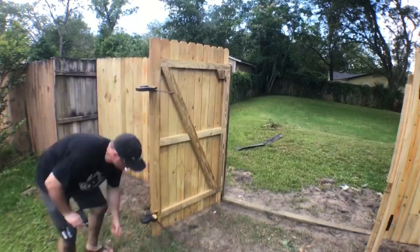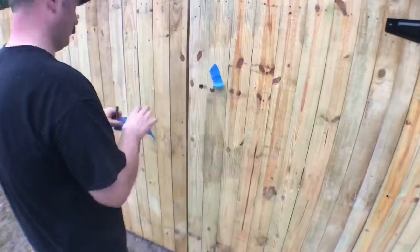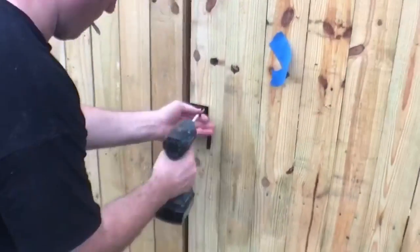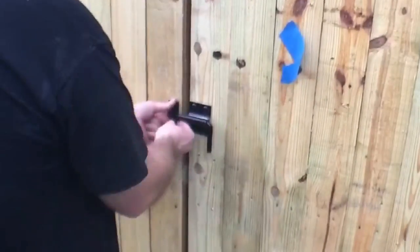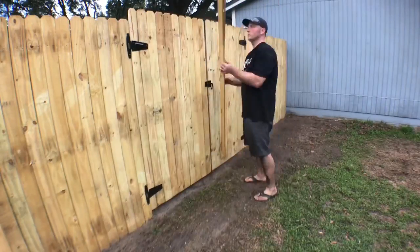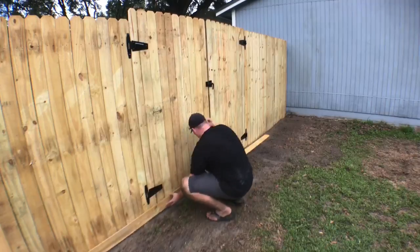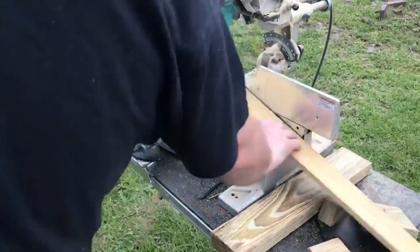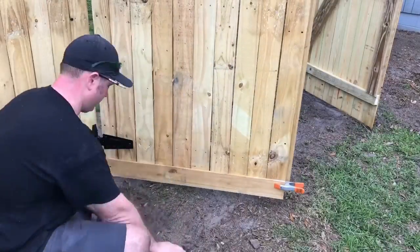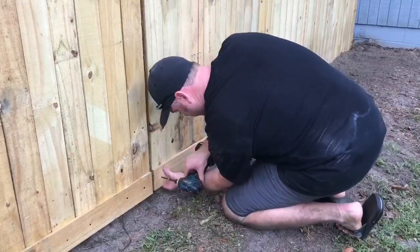This left gate is going to be locked in place into the landscape timber, so I put a backer board on the back of that gate. I'm using some blue tape to help me install the hardware that's going to lock the gate together. Once the lock is installed, I clean up the bottom by cutting some pickets to the length of each gate and installing them with screws. I use a squeeze clamp on one end, level it, and repeat on the other side — gives it a nice clean look.